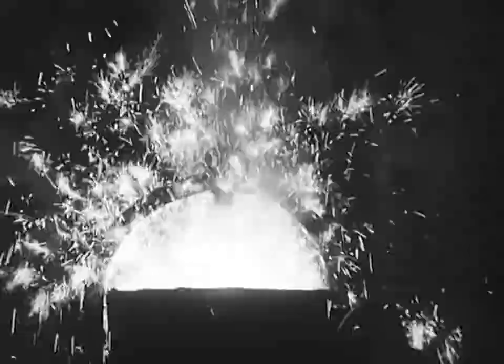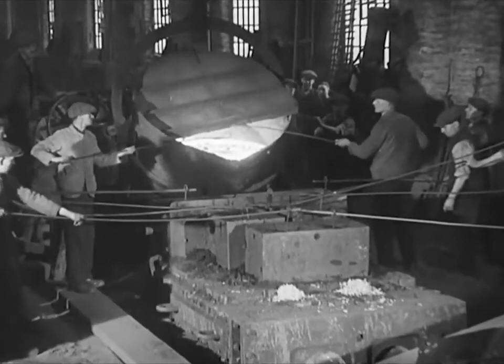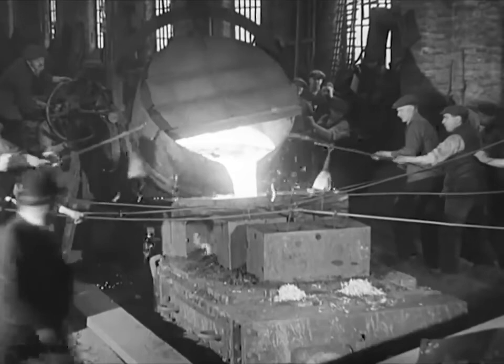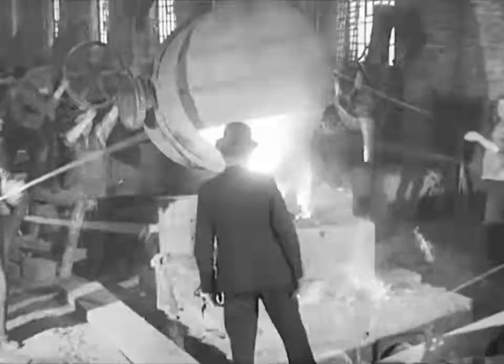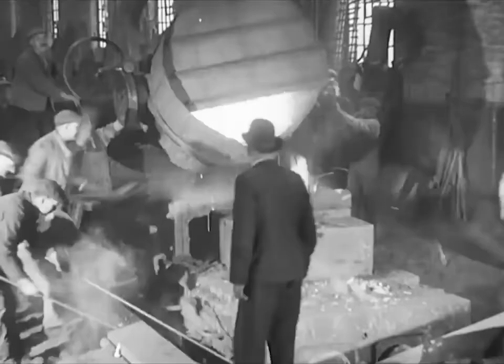Casting is worrying work. The cupola has to be tapped at precisely the right moment and the four tons of white hot seething metal taken to the site of the cast immediately. The critical moment arrives — over she goes. The aperture into which the metal is poured goes by the name of the runner box; it acts as a sort of funnel. The foundry foreman takes up his position and carefully watching gives the signal to pull the plugs. Immediately the cast is complete, this allows the gases given off by the hot metal to escape. Metal may set too quickly near these plug holes and these men carrying out an operation called feeding are preventing this from happening.